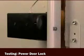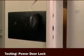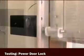The final step is to test the power door lock. With the door fully closed, the lock bolt should be protruding through the track. Operate the door in the open direction. The lock should retract before the door begins to move.